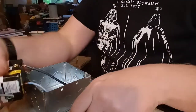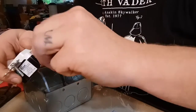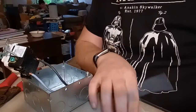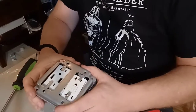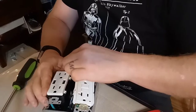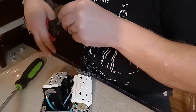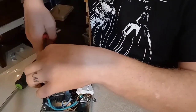Now we'll take the stickers off this side and take these short wires I cut off earlier — strip them and wire the two outlets together. With the two outlets wired together, before we stick the cover on we've got two clearance issues: these tabs that are for a different style outlet, and these tabs here which are for a different way of installing the outlet. So these just break off. I've heard of people who grew up in the Depression saving these little tabs and then using them later as washers.